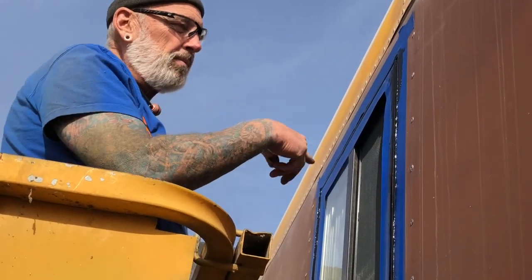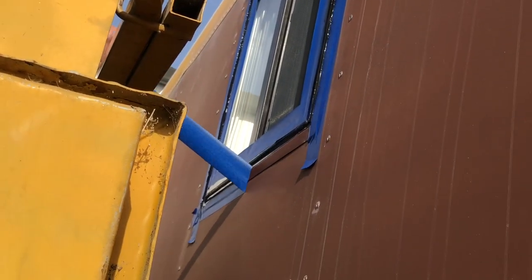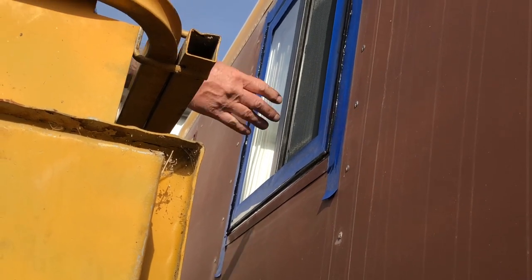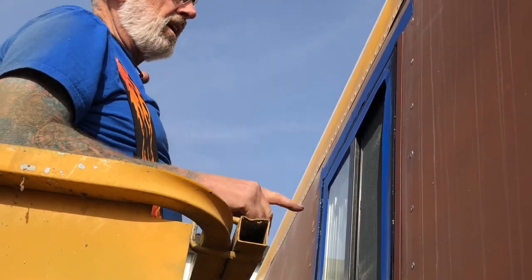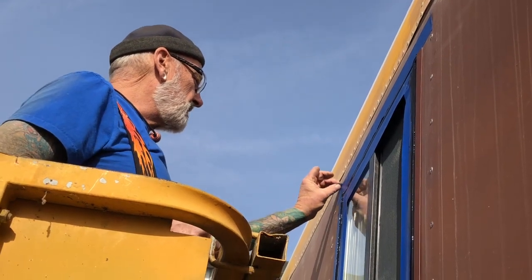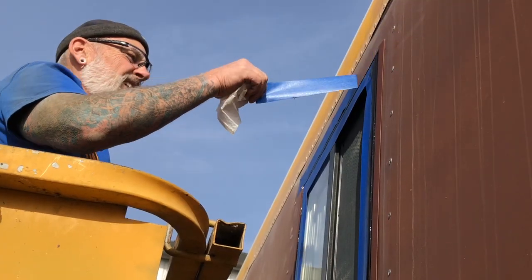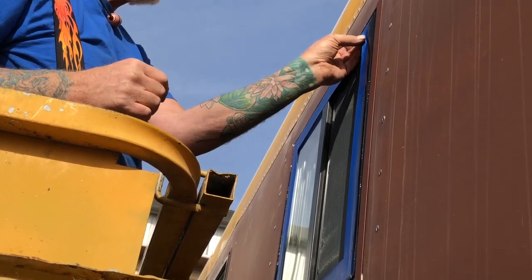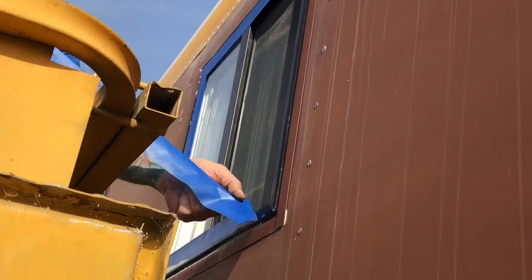The gap around this was all planned out from the start. When you caulk, if you mask off like this, it lets you push it in and use your finger to force it down into the crack. Then smooth it — with silicone you've got a little bit of a window before it starts skinning over. Getting it all pre-planned and pushed in, the tape keeps you from getting it where you don't want it. I'm being very careful about when I peel the tape.